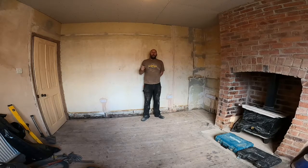That leaves one room - the dining room. There's been a door moved, French doors going in, and the fireplace has been taken back to brick, so there's quite a lot of changes in here. This is probably the best room to completely renew the skirting board. The walls are going to get skimmed at some point, but I've decided to put the skirting board on before they get skimmed because that's how the rest of the house is done - I just feather it up when I come to do it.